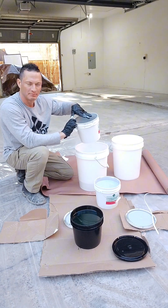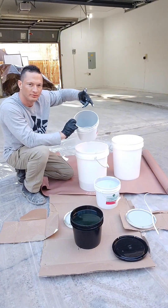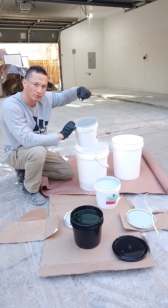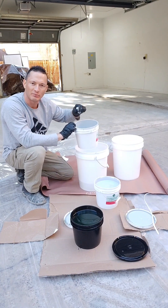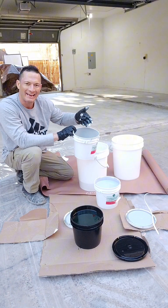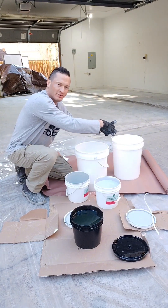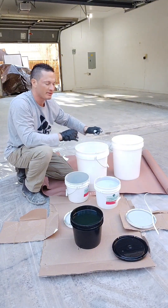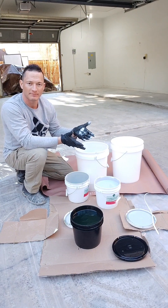Theoretically, if this had been the mixing bucket and I had A in here and added B and mixed it, some of the A would still be clinging to the sidewalls and the bottom. So later, after mixing, if I didn't pour it into a new container, I would have dipped my mini roller or brush in, touched the sidewall, grabbed that unmixed Part A, and transferred it to the floor — and that Part A would never dry. Or if I ran out of epoxy and turned this upside down to get the last bit out, that A would ooze onto the floor and you'd have spots that never dried. So always mix in one container, pour it into the next container after it's mixed — A, B, mix, add solvent, mix, then pour into a new container and pour onto the floor. Whatever you pour in the second bucket first is already catalyzed, already mixed epoxy, not just A or B.